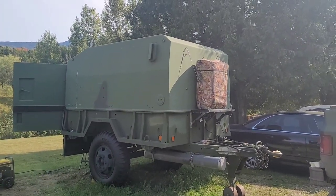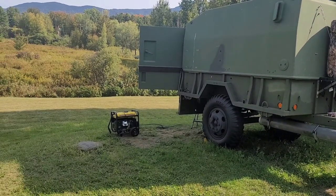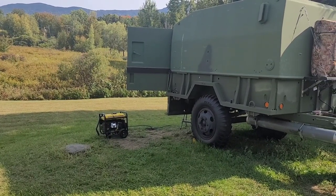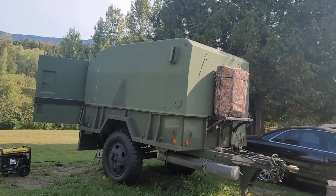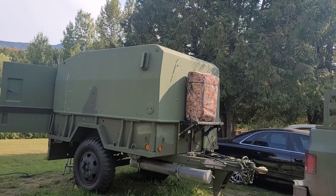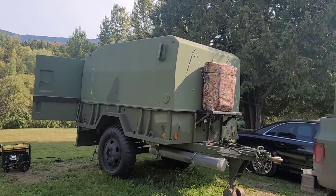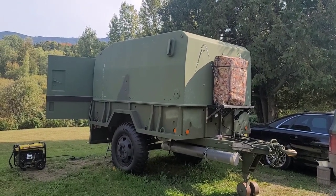To summarize: we hooked up 40-pound propane tanks and created a pretty versatile setup compatible with just about any propane appliance as well as two different style generators — one using an auto changeover regulator, and one where you can run either single or dual tanks drawing down at the same time. I hope you enjoyed the video. I know it was long but I wanted to make it as detailed as possible. I have another propane video linked in the description covering a 100-pound tank hookup directly to the 12,000-watt Duramax. Keep prepping — Vermont Prepper out, take care.